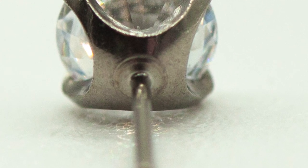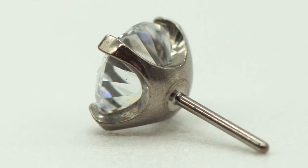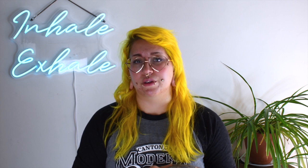Again, that's the part that's coming in contact with your body. Not only that, but if we zoom in inside the prong setting, we can see that they have just left that area unpolished — and a lot of lower quality or cheaper jewelry companies do this. They say it's not directly in contact with the client, the gem is in front of it, so we don't need to polish it. But polishing the interior of a setting is actually very important for making a piece look nice and stay looking nice.